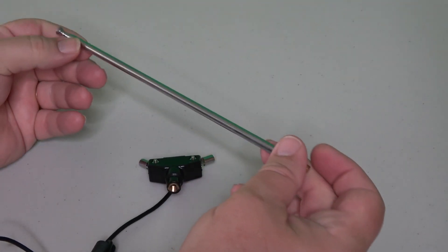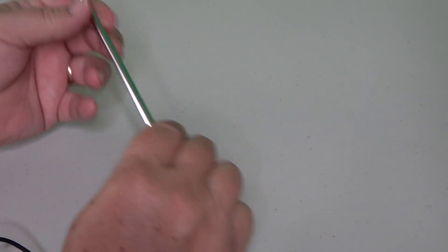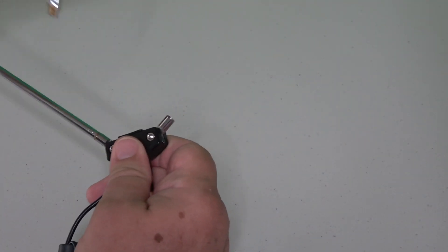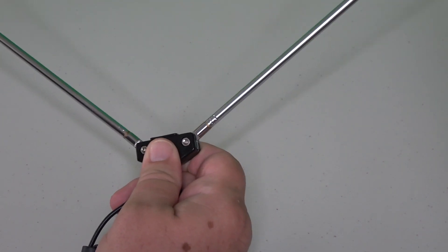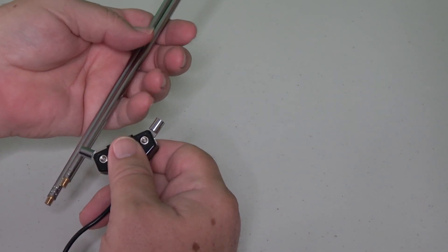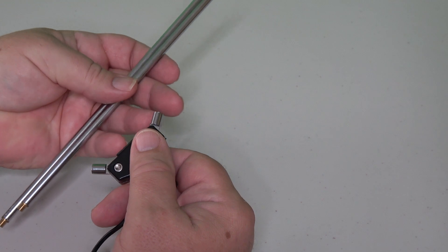First is the longer antenna arm — about 10 inches long, and extensible, so it will remind you of the old rabbit ears on the TV from your past. These simply screw in and make what is basically a dipole-style antenna with the feed point in the middle, with one on each connector. You can extend them to the distance that best works. There are formulas to help you extend these to the proper length based on the frequency you're targeting. These would be used in the lower frequency range, the 2-meter range — around 144 megahertz — because they are a little longer.